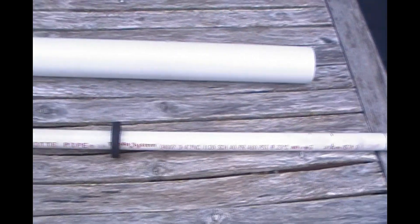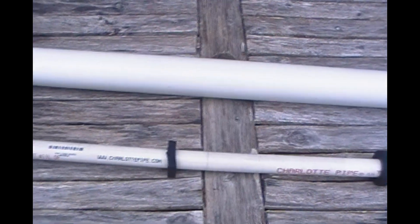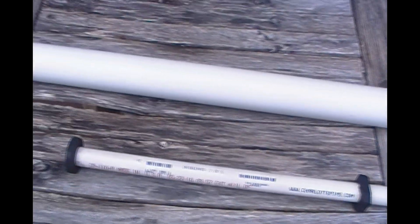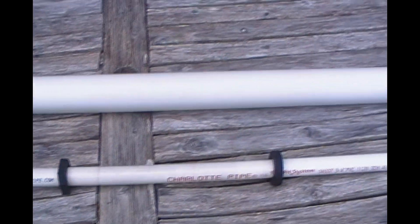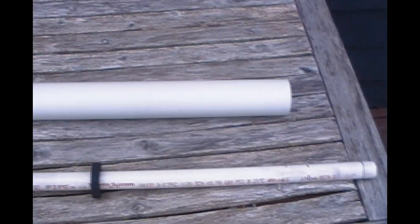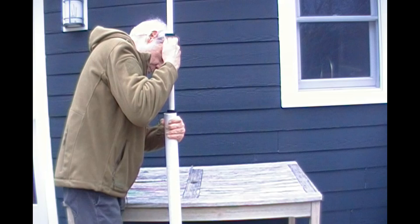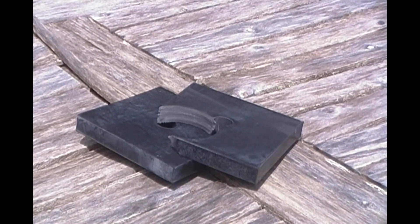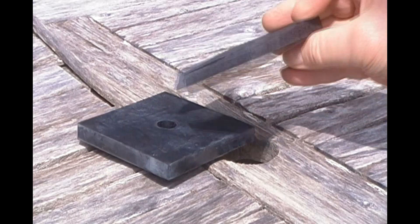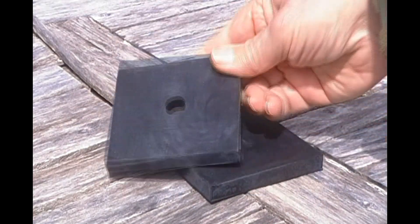The all-sky camera isn't merely mounted to a pole — the pole is the skeleton of the camera. It's a combination of a ¾ inch PVC pipe and a 2 inch PVC pipe. The smaller pipe is the backbone of the camera, while the larger pipe is there for support and rigidity. The pipes are coaxial and are held in place by rubber donuts — these are anti-vibration pads that I cut the donuts from. I think I got these from Home Depot; if not, the link in the description is for identical pads.